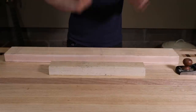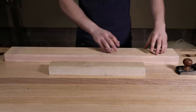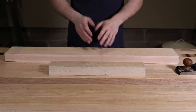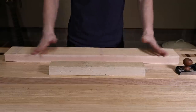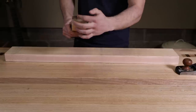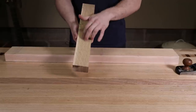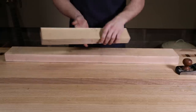Okay, so what we've got here is a big old slab of beech to start with, which is perfect for chopping boards. It's got a really tight grain on it so it doesn't get too mucky — you don't get too much gunk stuck in there. It's quite dense, quite hard, and it's also pretty forgiving to work with hand tools. And here we have got a bit of oak. The nice thing about this oak is that the growth rings along here are perpendicular to the top face, which means it is perfectly quarter sawn, which means we get some really nice medullary rays along the top here — a sort of sought-after effect with oak.